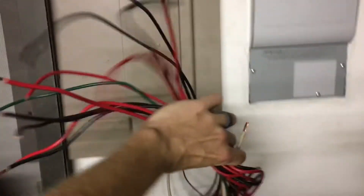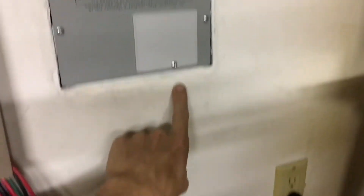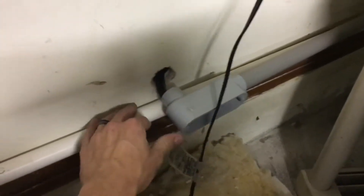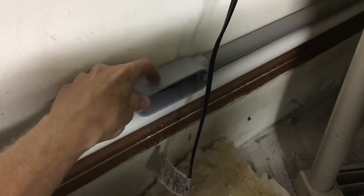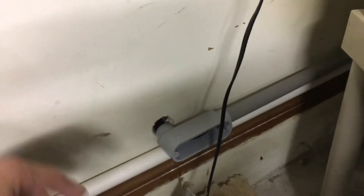These are them actually coming through here and up here — these are the wires I'm going to wire up into the breaker panel. The power from the power inlet box that will plug into the breaker goes all the way down here through the wall and out this wire here. I used a pretty thick wire — I went a size up from their recommendations because I didn't like their recommendations; I thought the wire they used was too thin of a gauge. That comes out here into some grey conduit, which goes through my garage wall into the power outlet box out there.